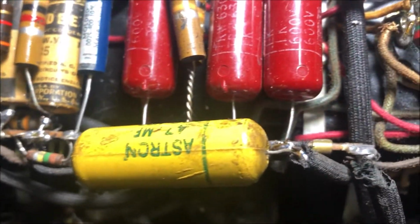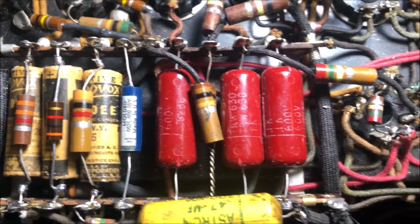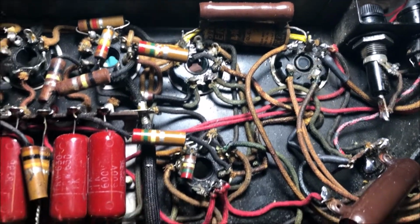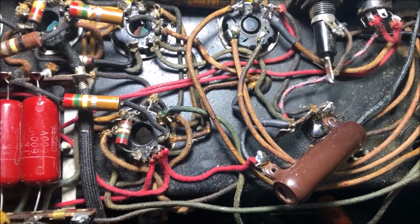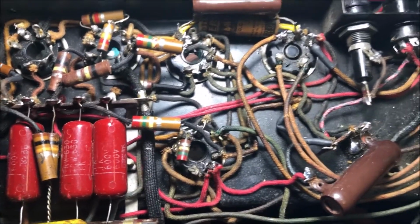And from there it also energizes the third cap, which is hooked up there, and then the fourth cap is over here going off to these preamp tubes. I'm pretty sure that's correct, but time will tell. Right now I got it, I can turn it on. I got nice high voltage going to all the caps coming off of that rectifier, and I put red wire here, which kind of stands out, but I kind of like it because it's showing the B plus for future do-it-yourselfers.